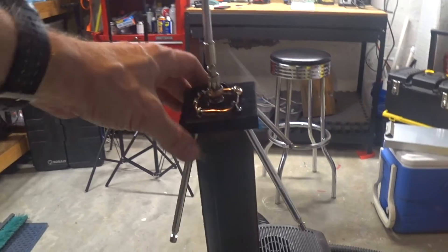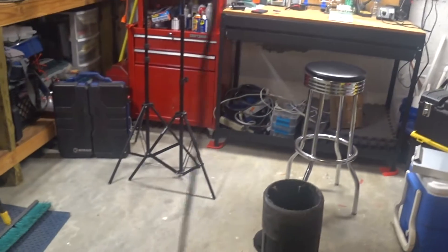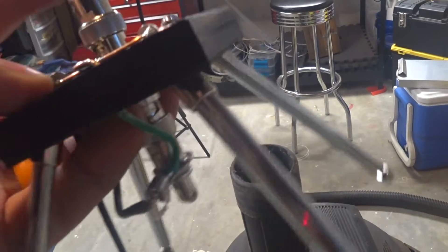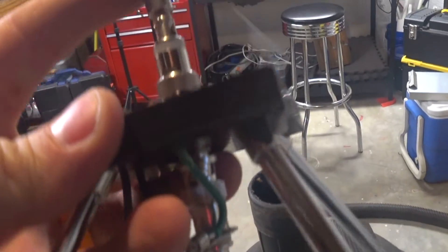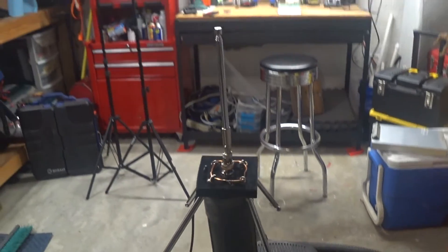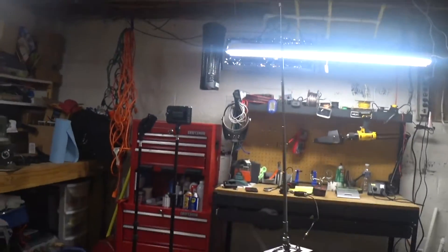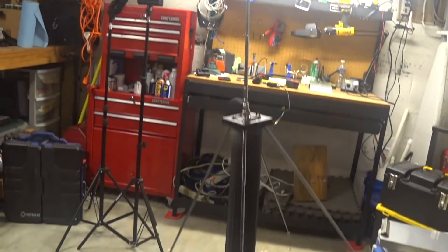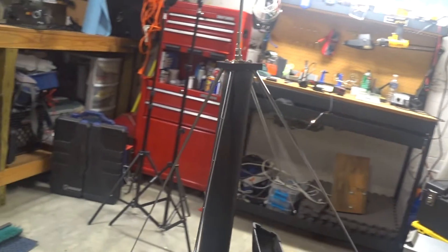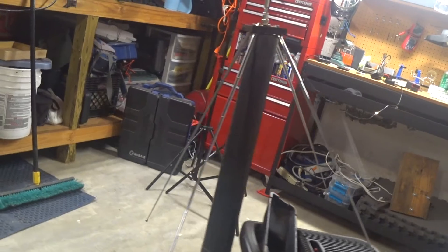Here's what I've got with the antenna so far — I'm using my shop vac as a stand right now. As you can see, I've got about almost four feet of coax with an SMA connector on it. I ohmed out everything — nothing is shorted to itself, the aerials are all grounded together, and the center conductor is all in its right spot. It weighs 264 grams. The aerials are not perfectly symmetrical at 45-degree angles, but it's not bad.